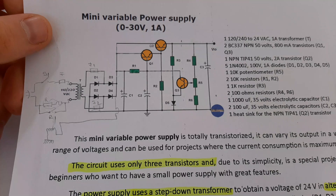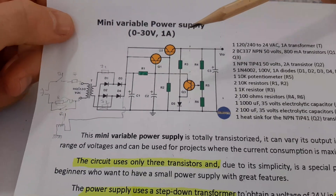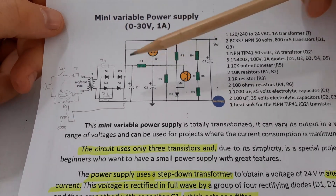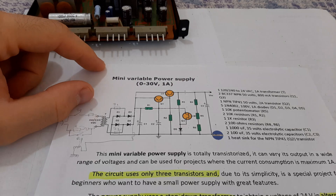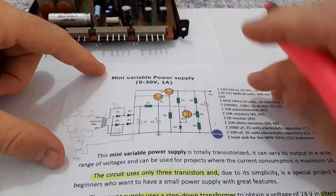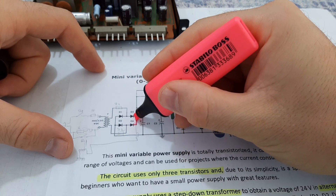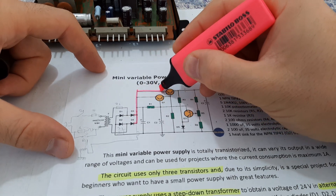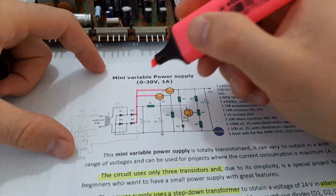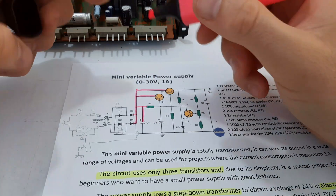Here there are more power supplies but we will discuss about one. This is the diagram for this power supply. This power supply has a component like that — a full wave bridge rectifier. So you will have here the plus going on top, from the cathodes of the diodes. Let's take a highlighter and discuss exactly what's going on. The plus from these diodes is going on the collector of Q2, on the collector of Q1, on this resistor, and on this capacitor.